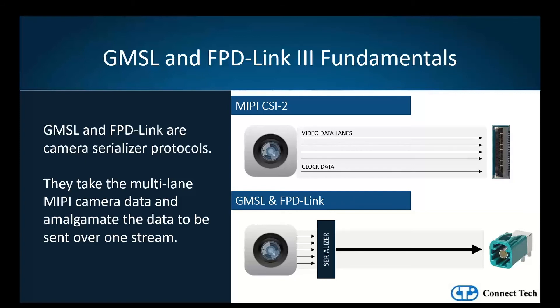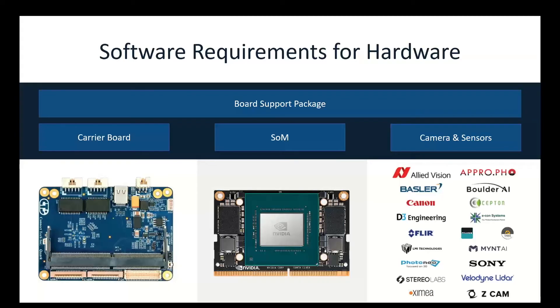While many camera vendors have not adopted a standard connector for these protocols, the vast majority utilize a variant of the FAKRA connector adopted in the automotive sector. Customers can purchase cables that merge four separate FAKRA connectors into one quad connector, keeping camera streams independent while lessening routing complexity. Now, turning to software challenges: once companies are ready to move from a developer kit to production hardware, sensor software integration for MIPI, GMSL, and FPD-Link cameras will be required. Any additional interfaces outside those on the development kit also need proper mapping within the module's low-level configuration.